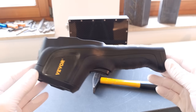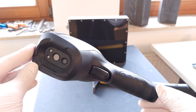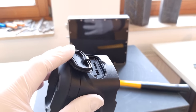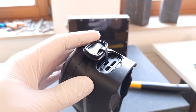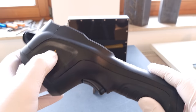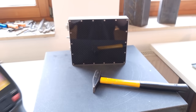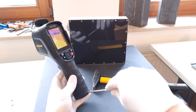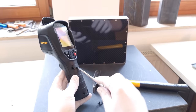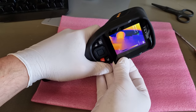My initial impression of the outer body being rugged was entirely correct — this was one tough nut to crack. The only obvious screws hold down a small cover over the USB port and the SD card slot. All seams of the plastic shells are disguised and protected by a thick rubber layer — nothing to poke into and pry open, no screw holes hidden under the stickers. I was already thinking about getting it x-rayed or to turn green and start smashing, but then I finally discovered the sneakiest screw hole covers ever. Unfortunately, that discovery alone wasn't good enough — I also had to peel away the display cover, revealing yet more screws.